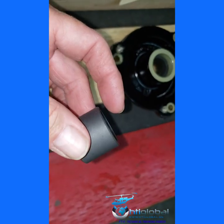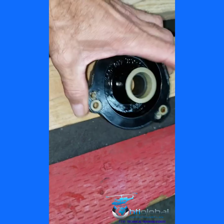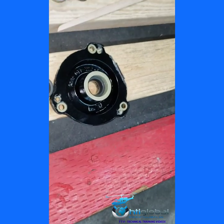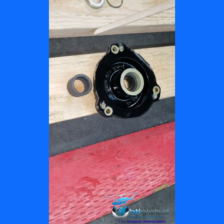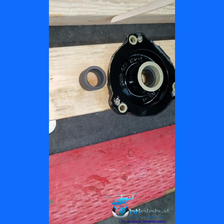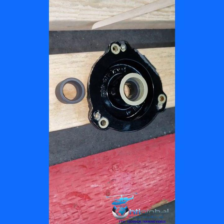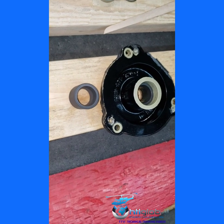Here I'll explain the bearing replacement. This bearing goes inside here — this cap goes on the left side of the 90-degree gearbox. Its function is to make sure the push-pull tube goes straight and centered. Over time you'll start seeing wear here on the push-pull tube, and with play present, that play can induce vibration on the tail rotor, affecting the crosshead, pitch link, pitch horn, and tail rotor blade. So this is very important when checking the tail rotor — if you can move the blade sideways while trying to change pitch, there should not be much play, and it could be this bearing.